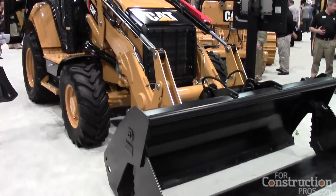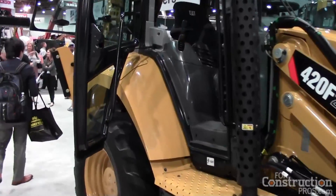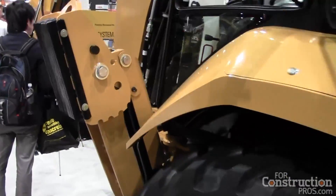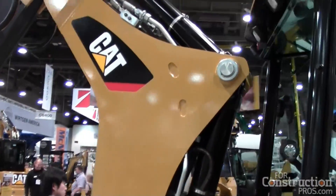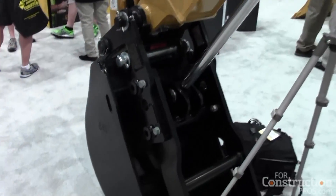We've heard a lot of positive feedback from customers that are running these machines. But it's not just about the cab and those aspects of productivity. There's also a pretty significant efficiency advantage with this Tier 4 Final version of the backhoe. Of course, right now fuel costs are pretty nice, but they're probably not going to stay that way. Transmission-wise, we now have available an optional lock-up torque converter. So if you're doing a lot of roading on that machine, when you get into high gear the converter's going to lock up — it's like going to direct drive, you get higher ground speeds, and you're saving fuel. People have seen up to 25% reduction in fuel just in roading with the lock-up converter.